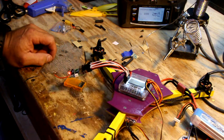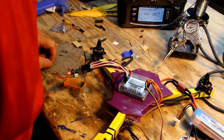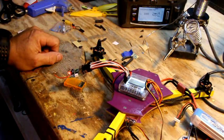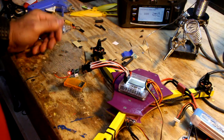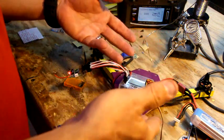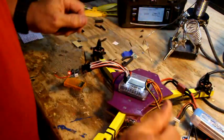I'm going to go ahead and set up the servo now, since it should be pretty much straightened out, I think. Let's just pretend like it is. You may have to go in here and program the tricopter first to get the servo to center up, but we're just going to assume that even as a multi-rotor, right now it thinks it's a quadcopter. We haven't set up the board yet, and so it should have everything centered.